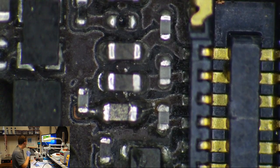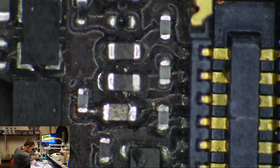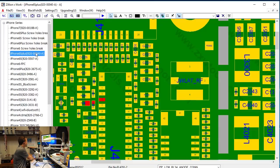These are going to pertain to backlight. So here's screen capture. We've got these three filters here, and the bottom one of those three has had the most work on it. This is one of our backlight anodes. We have two cathodes and an anode. It is okay that they've got the solder bridge between here and here, as well as here and here.